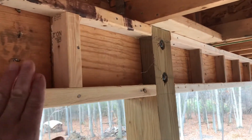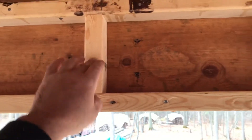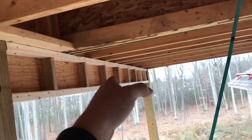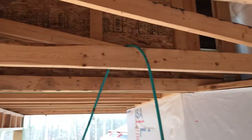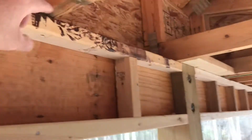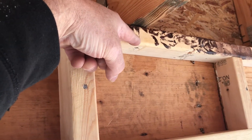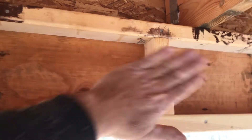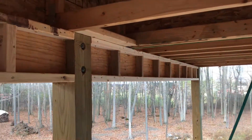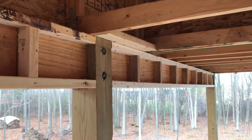The reason why I'm putting these pieces in is because you wouldn't need these usually — you'd just have a really clean eight-inch width there. The reason for those blocks, and I still did 16 on center from the edge where some finished roughs will eventually be, is because we're gonna be running the tongue and groove the same way as the trusses. So we have to first strip this down, running the first strips this way — the first strips are three-quarter — and then once you have the soffit put on you're at inch and a half. Even though this looks like a backer now, it gives you nothing to fasten the fascia board on because you'll just have air there, so that's why we're putting these blocks in. All those blocks are doing is acting as something that will catch the rough sawn that goes on the side of this.